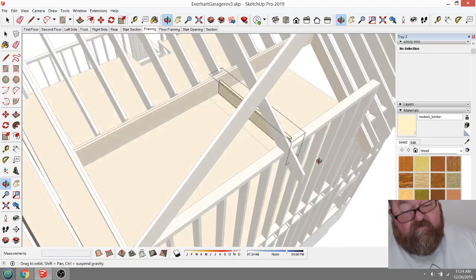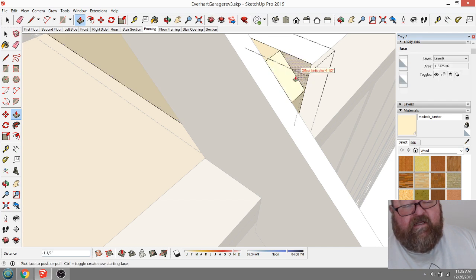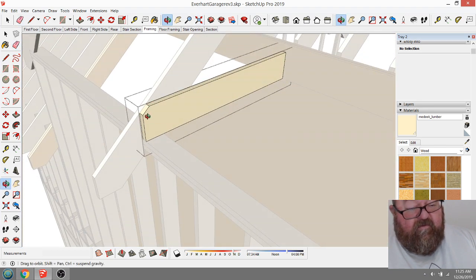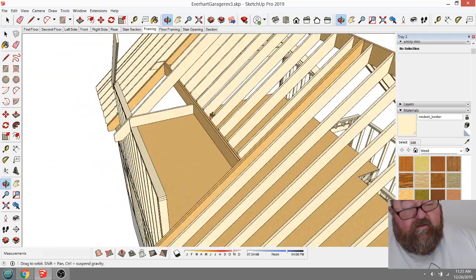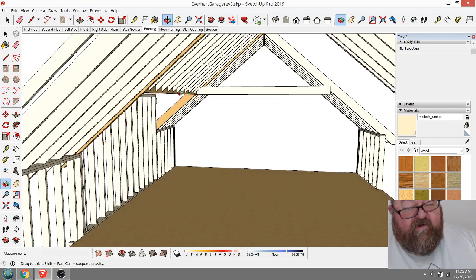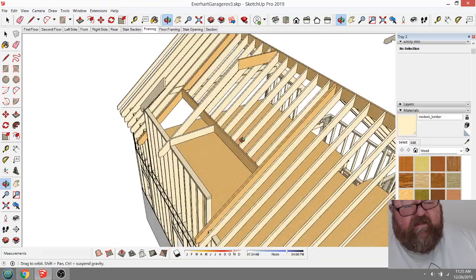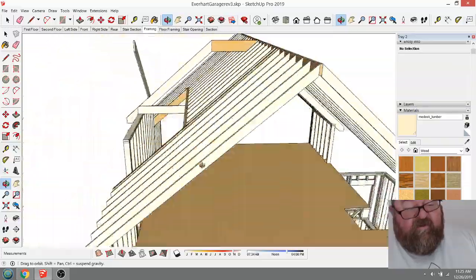And then on these ceiling joists, you'll just nip off this little part right here with your saw. When we're cutting those, we just eyeball it because we get an idea of how much it is. This may seem kind of weird, but if you look at the ceiling level, the ceiling's going to be the same height all the way across, and you'll never know it. When you're standing in the room, you'll never know there was this transition where these rafters come down and stop. Obviously, if they kept coming on down, they would be in the way of your dormer ceiling.